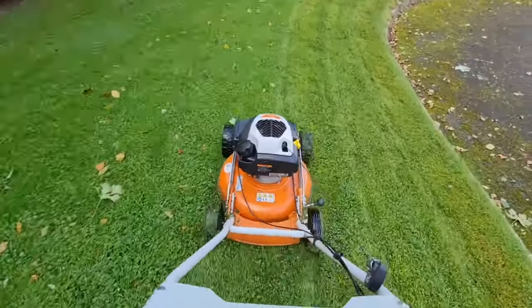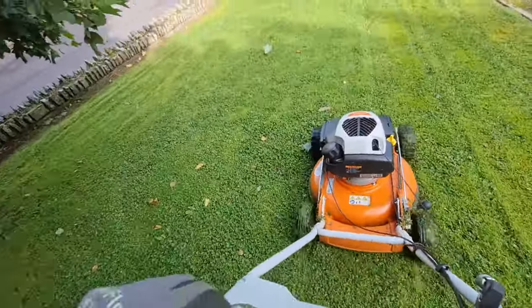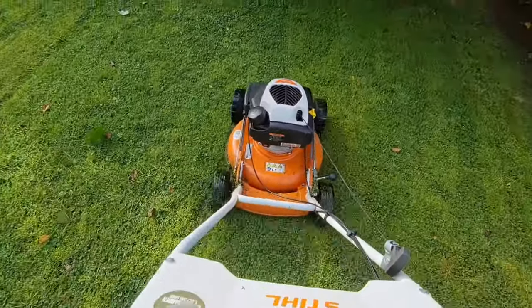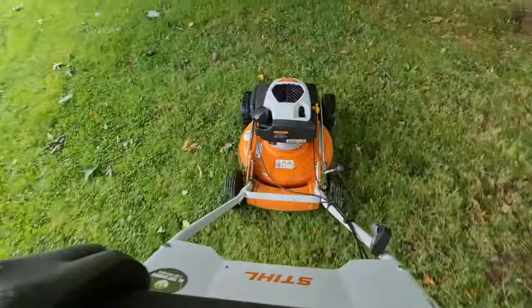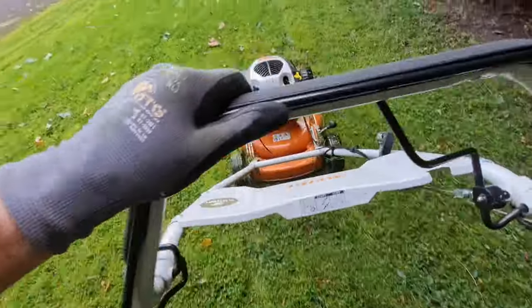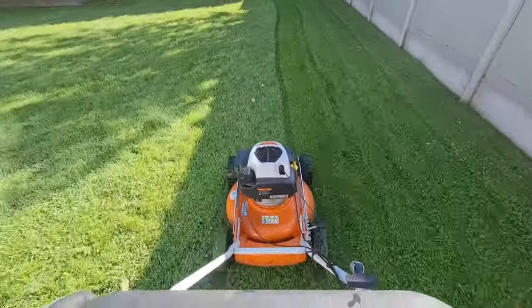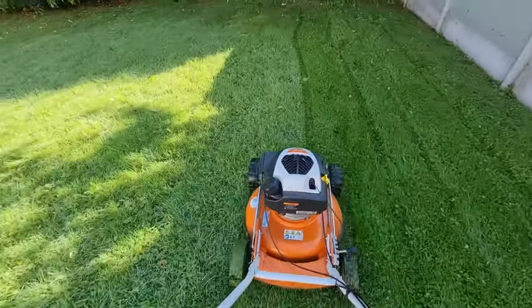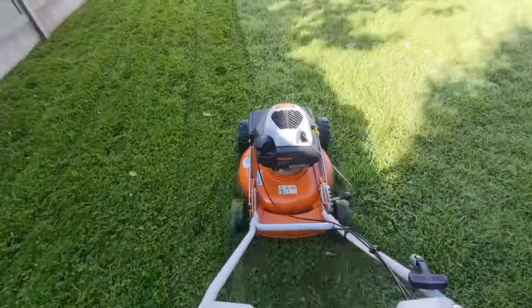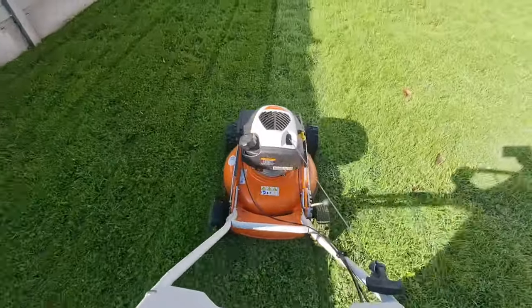The front wheel belt-driven system does less damage to a prestigious garden. When turning, you can tilt the machine up and leave the rear wheels placed on the lawn, releasing the drive wheels off the grass so there's no digging — whereas with the rear wheel drive Stihl RM 655V, it digs into the ground and I end up repairing the lawn afterwards. The aluminium wheels are very tough, especially coming in and out of the van.